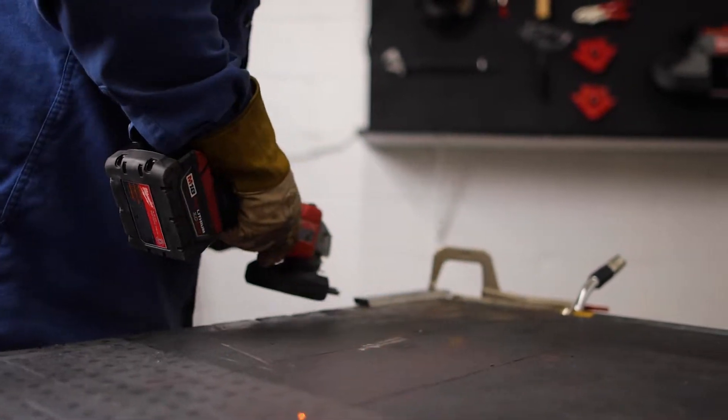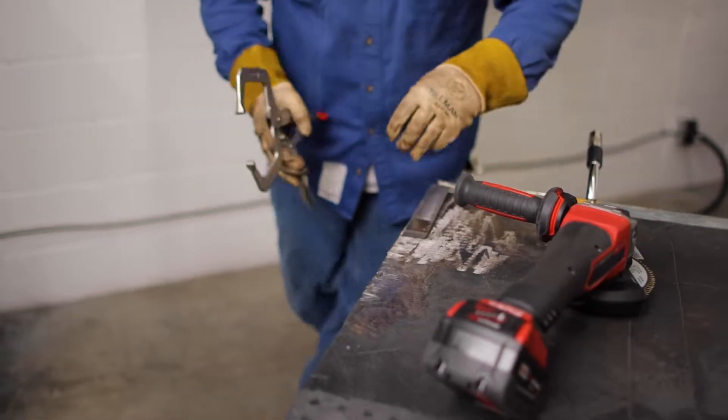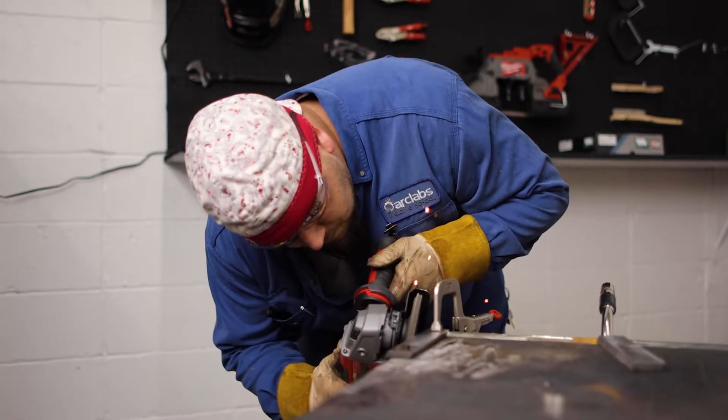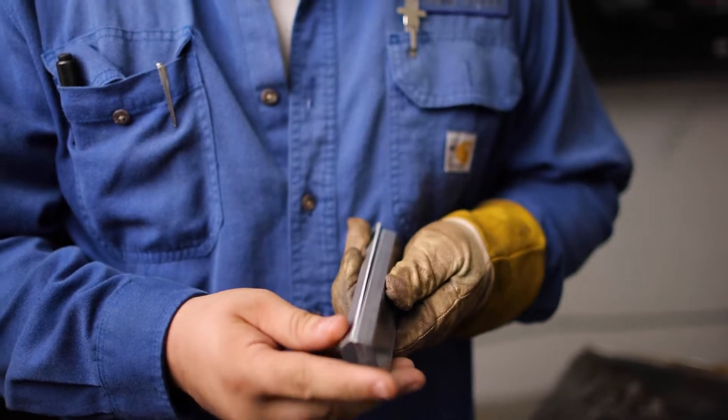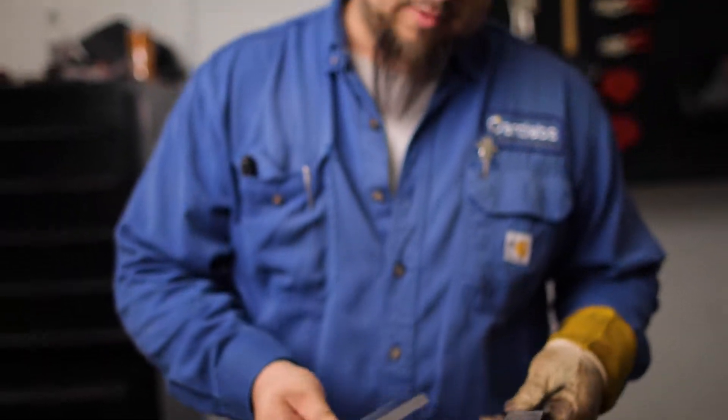See, it's pretty close. I got a piece of 3/32 TIG wire. What I've done is prepped both of these plates with a landing — I like 1/16 to 3/32, it's just what I like on them. Try to match them up the best you can, because the last thing you want is a bad joint prep.